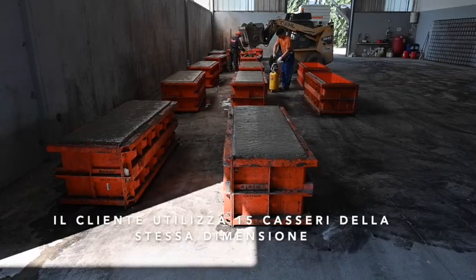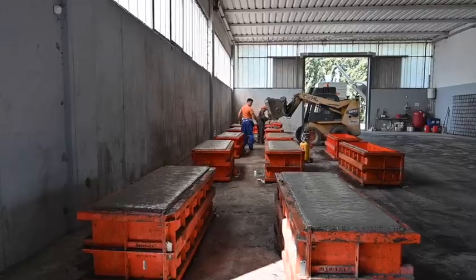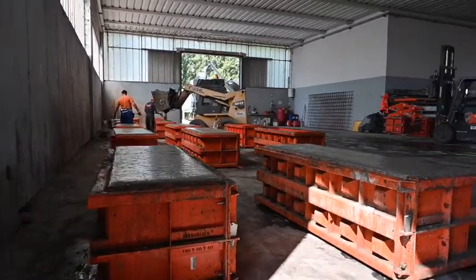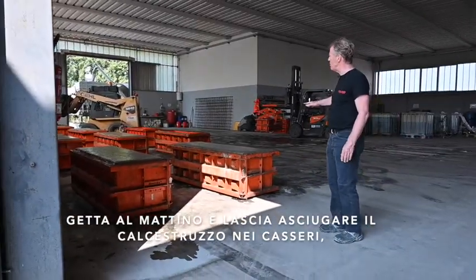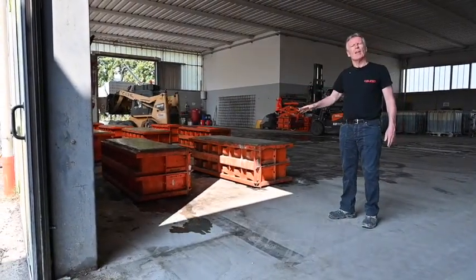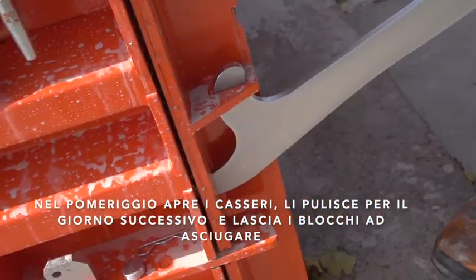This customer uses 15 moulds a day and only pours once a day with each mould. He's using these blocks for himself. They work early in the morning and by nine o'clock they've finished — they fill all the moulds with the recycled concrete produced using the blend, then leave the moulds and blocks to dry. During the day they open the moulds, leave the block to dry, take the mould, clean it, and prepare it for the next day.